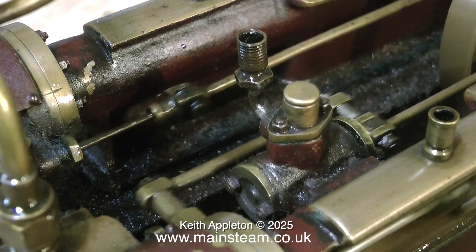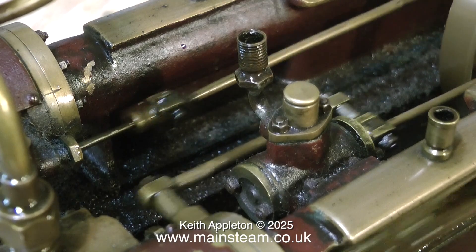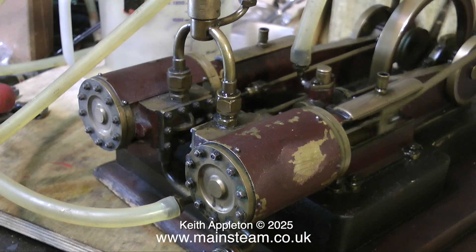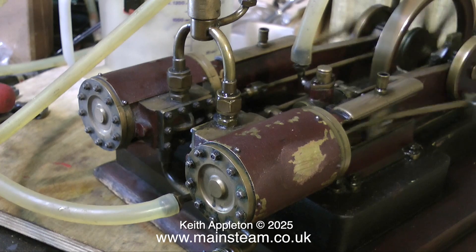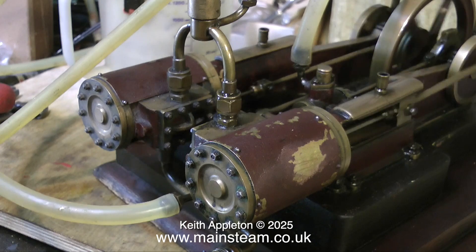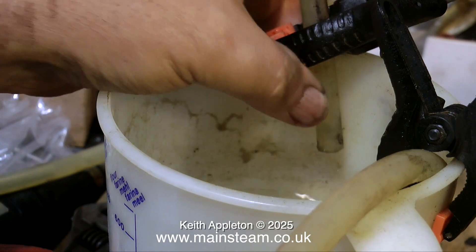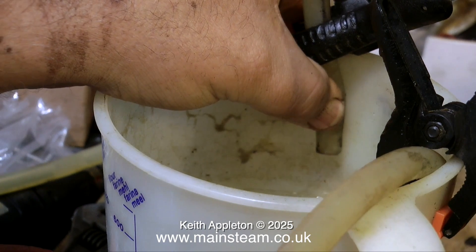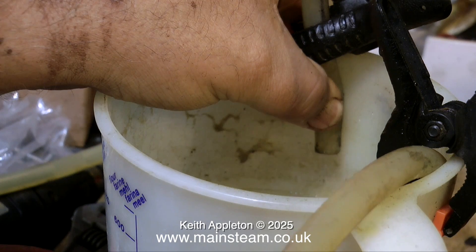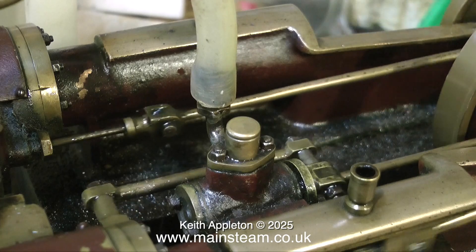There is one aspect of the design I'm not too thrilled about, and that's the way that the water pump is driven from the same eccentric that drives the valve in the steam chest. When a steam engine is under steam or compressed air, the slide valve is being pressed very hard onto the port face, and this puts quite a strain on the eccentric. This is compounded by the eccentric driving the water pump as well. Having said all that, it seems to work. But if I nip the pipe, as you see me doing here, the first thing that happens is the eccentric's position actually slips around the crankshaft. So what I'm going to have to do is find a very secure way of mounting the eccentric on the crankshaft.